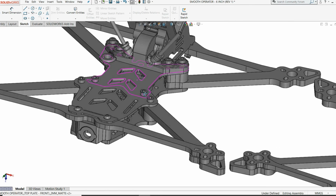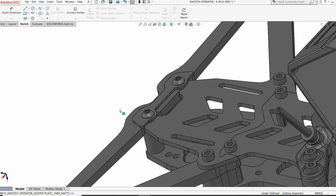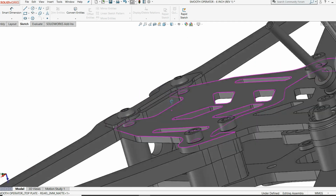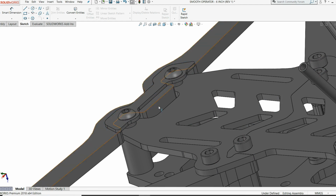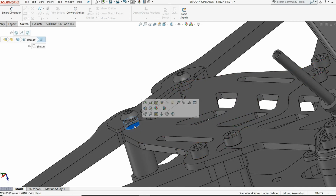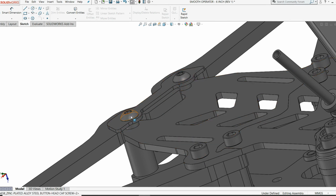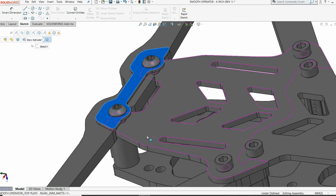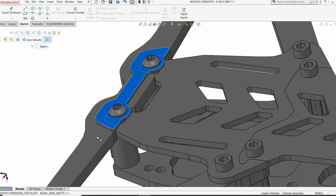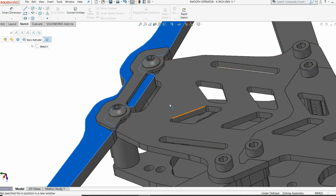Now, since we have started increasing the length of the arms and we've got greater loading on all of this, what I did is I've designed in a little keeper plate. This is a retention system that locates this brace in reference to the center section of the craft. And so we've got these little spacers here. These are little aluminum spacers that we like to use in all of our designs. You've got the screws and you've got this keeper plate. And so that just sort of clamps this thing down so it is not moving in reference to the fuselage here.